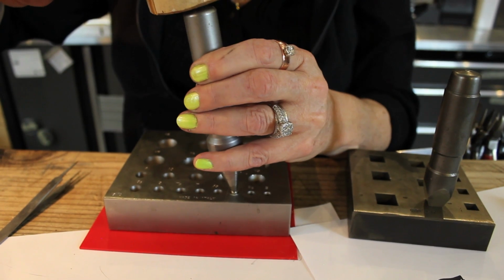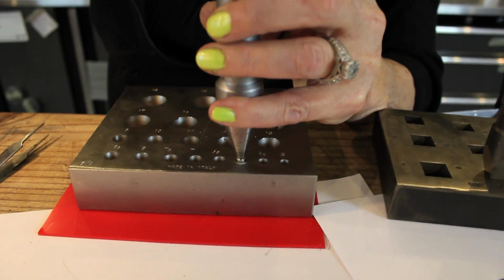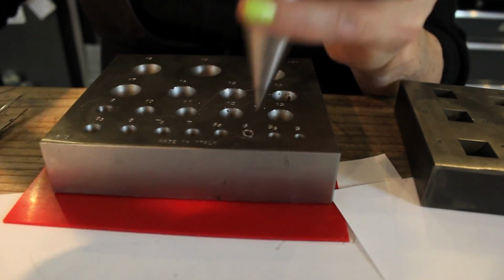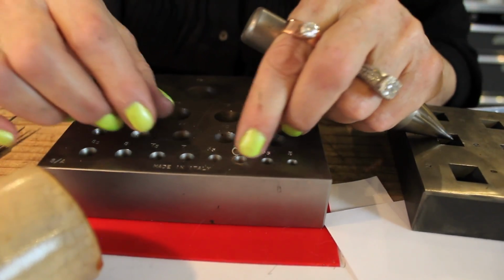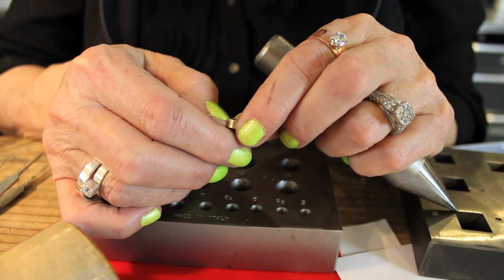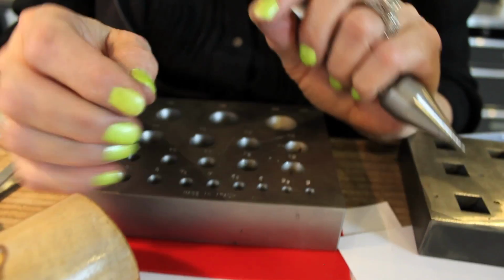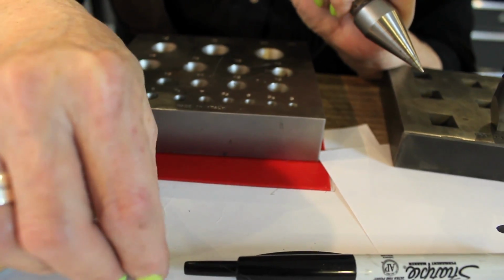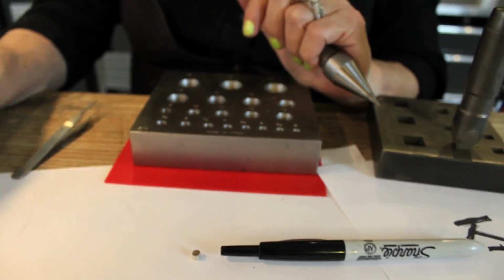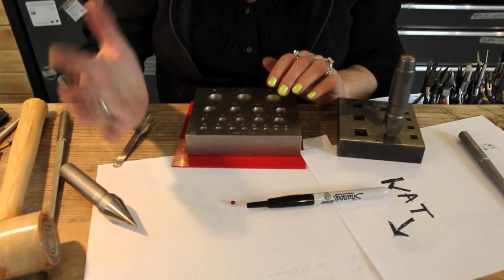and I can see that I'm not level on that. So what this is doing is compressing the bottom as well as expanding the top. So I would probably go and anneal that. It's just starting to curve open in the top and compress at the bottom, but I don't like pushing it because I have split so many of these dang things. So you just keep working on that, and then I would take my stone and check the fit on it and see how close I am to it. This is way far away.